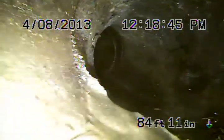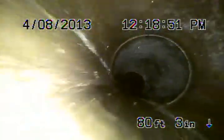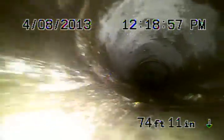This is all the 6-inch pipe out in the street, which looks like it's in pretty fair condition. There was one minor root just underneath the parkway, approximately about 6 feet deep. The 6-inch is very maintainable with a hydro jet.